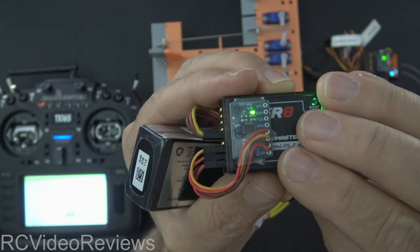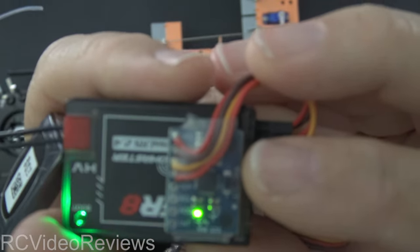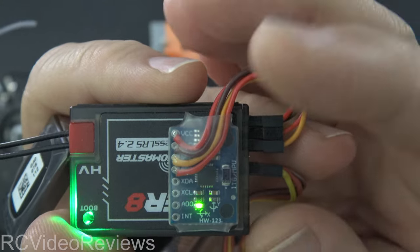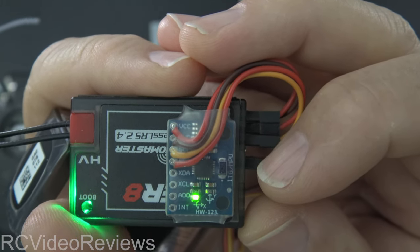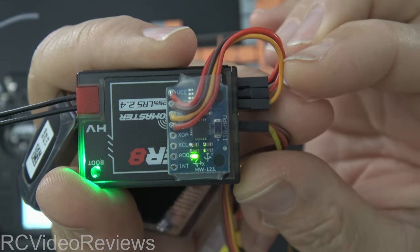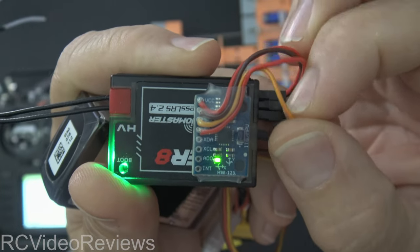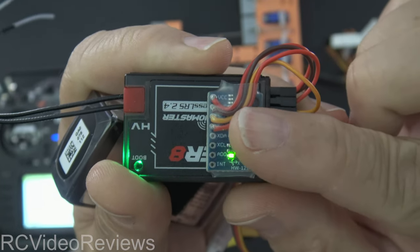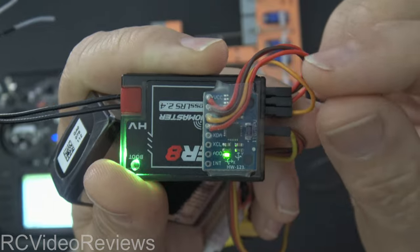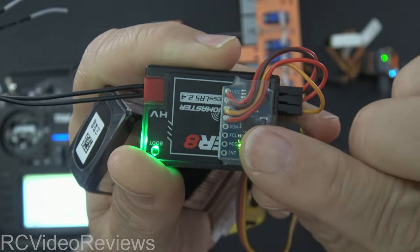Okay, so pins number 7 and 8 go to SCL and SDA up top, and I'll put that up there so you can see it. There we go. So there's your wiring diagram for the gyro. Get a close look at that. And remember, number 7 right here, this orange one is number 7. That one right there goes to the third one down. And then the red wire, this is pin number 8, that goes to the fourth one down.